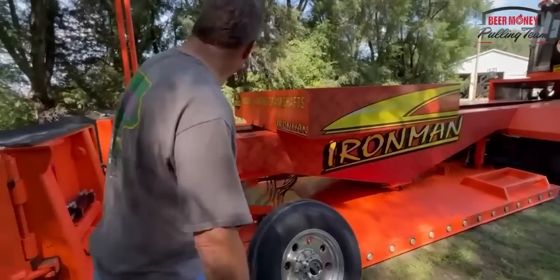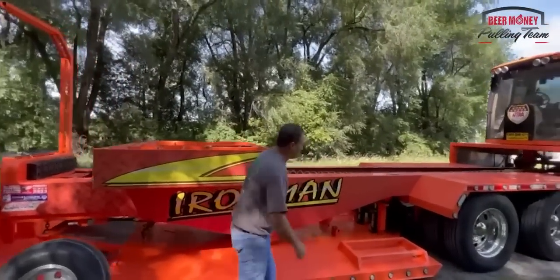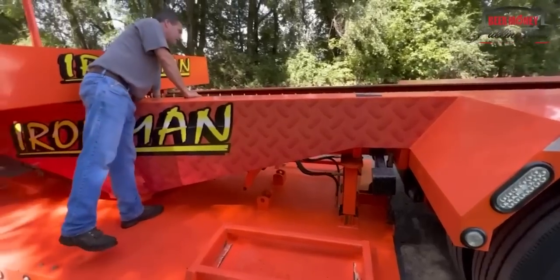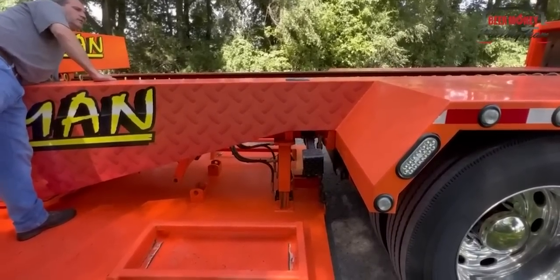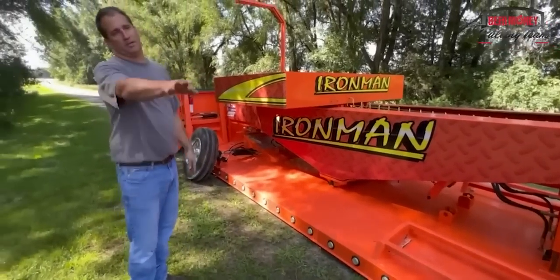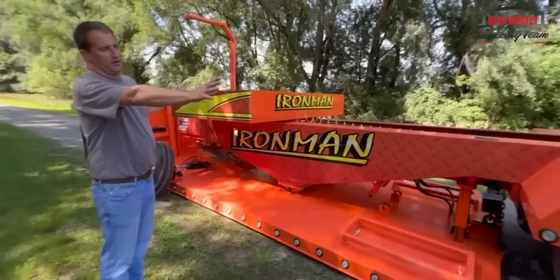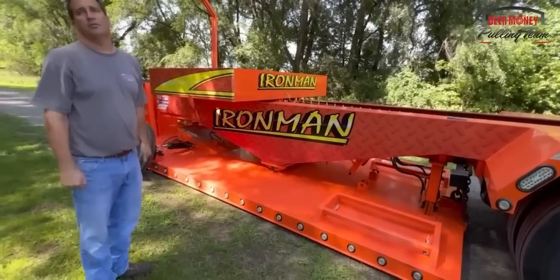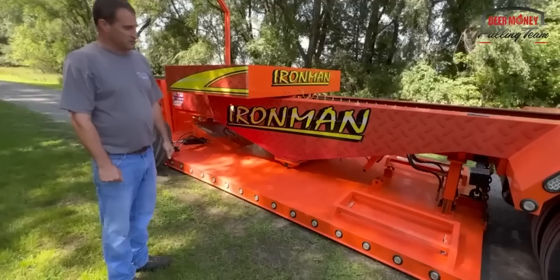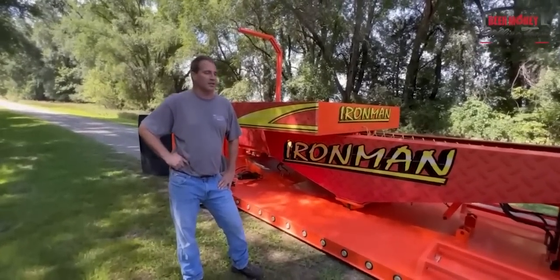So when the box is all the way forward, and the drive line is out of gear, we now have what you call a push down, and that's this here. So when that goes off, and I'll simulate that, it tries to pick the back of the sled up, basically. If there would be weight in the front of the box, it would pick the axles and back of the sled completely off the ground. Now you have every ounce of weight available pushing the pan into the ground. And that's what finishes the stopping. That could be at 280 or it could be at 320, depending, it's all on the adjustable class.